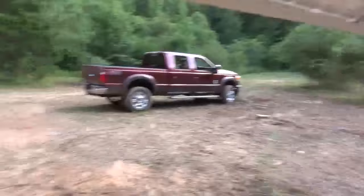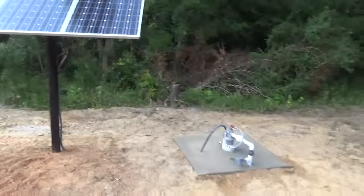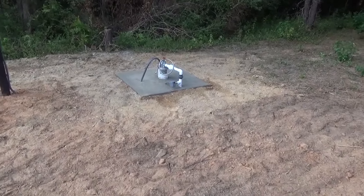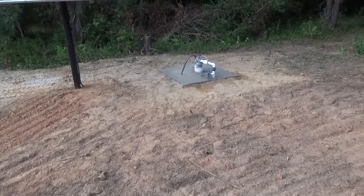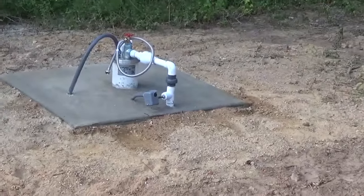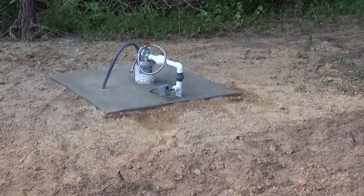I love this little controller — it's the CU-200, an accessory for the Grundfos SQ Flex series pumps. I'll show you the other accessory on phase two, which is the IO-101. That one allows you to run grid power or solar power to run the pump — makes it a very good solution for a lot of people wanting backup options to get water out of the well. We're a thousand feet from a tank that's partially buried. I'm going to get one of the fiberglass rocks to cover this up — one of the insulated rocks — and I always put dirt up on the lips so no wind or air can get underneath.